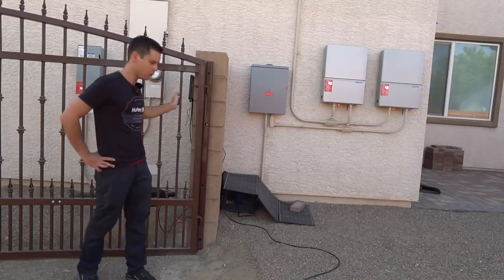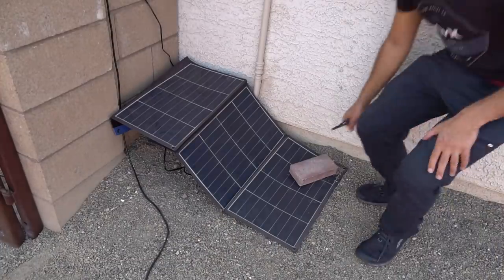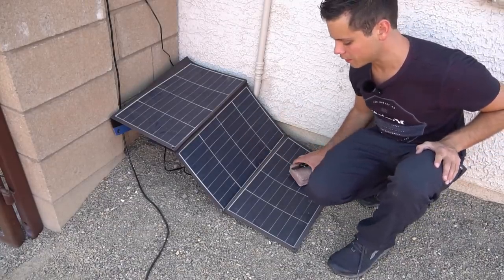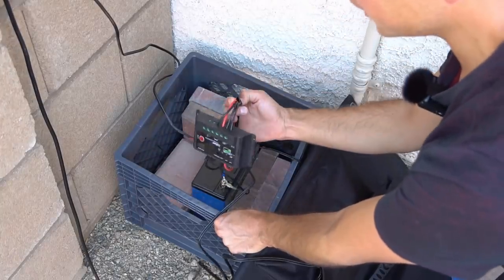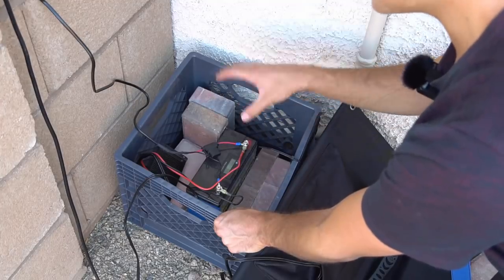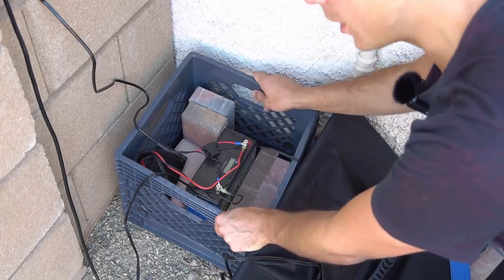On the front we have the control box, and on the other side where it gets more sunshine I built a micro solar power system. The original requirement was a 15-watt panel, so I added a 100-watt panel mounted to a milk crate with zip ties. The system has a pulse width modulation controller, a super cheap Talent Cell lithium iron phosphate battery, and a bunch of bricks because the wind on this property is absolutely insane — if you don't secure something to the ground, it will fly away.